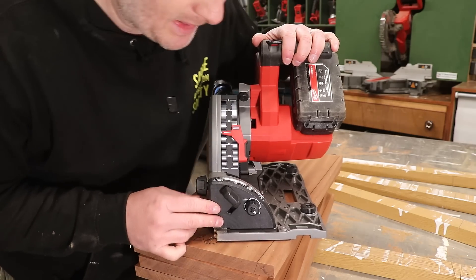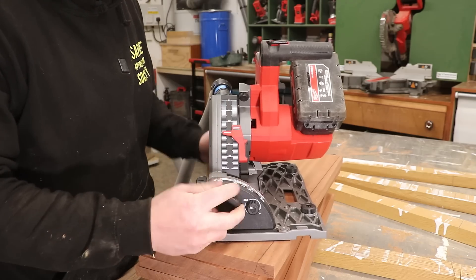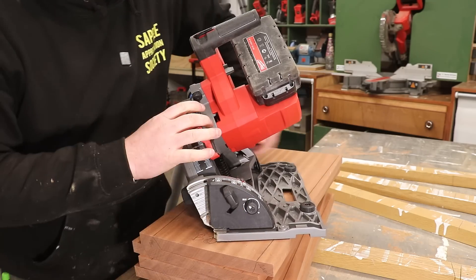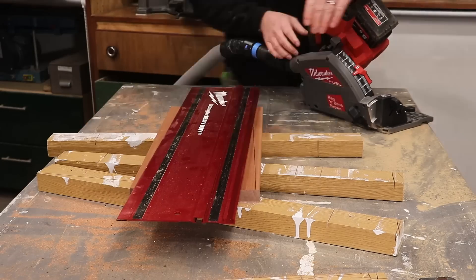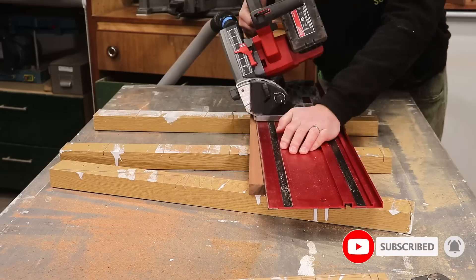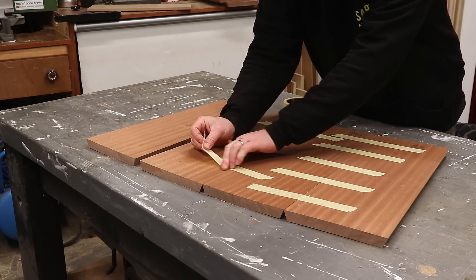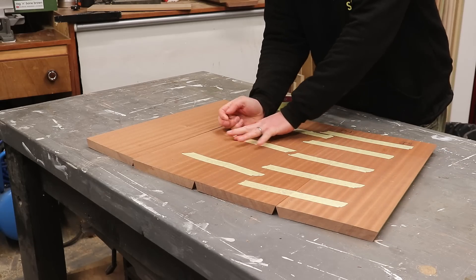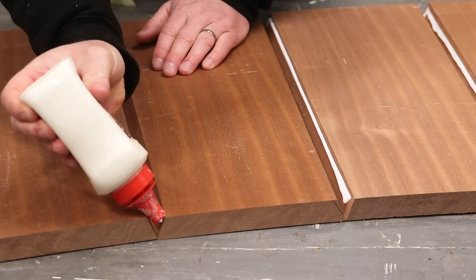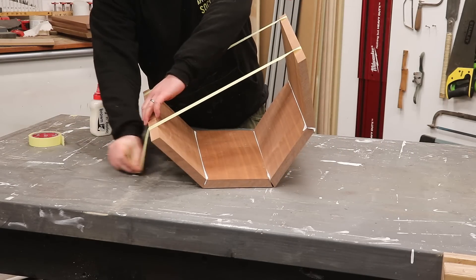Because the thing I'm making is going to be octagonal I need to make a 22.5 degree angle cut, and this saw has a setting for that, meaning that when I pivot the saw it will default to that position. I can lock it down there and that should be good. Time for assembly now, and I thought doing the glue up in two halves might be the best way to go, so I'm placing four of the boards next to each other inside face down so I can apply some masking tape, then I flip it over, add glue, and attempt to fold it together.